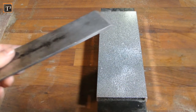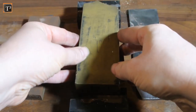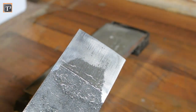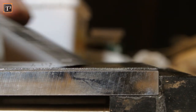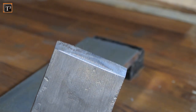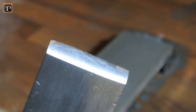The next passes were done on a 400 grit diamond stone and 1000 and 3000 grit water stones. This treatment of the back usually has to be done only once in a tool's lifetime. To sharpen the blade I put it on the stone at about 30 degrees and push it forward. The natural motion will lift the tip slightly up and thus create a camber. I've never noticed anything bad about such a bevelled edge and this method saves me a honing guide. From the shiny areas you can see that the previous grind was so crooked that material was taken off very unevenly. It was okay to still have small low spots at the sides as these will be taken away with future sharpening.